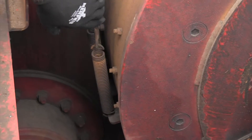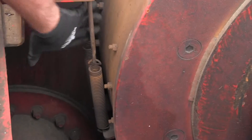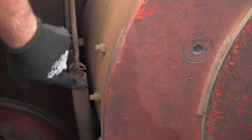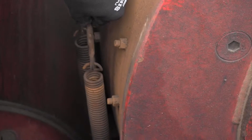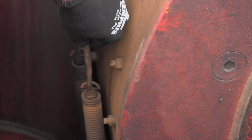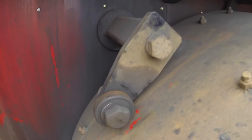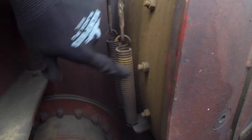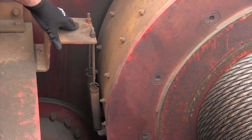In this case these springs could be a little bit tighter — it's kind of a feel test. Just a little bit of spring tension is what you want to see. This can move around a little bit more than we'd like; we'd like to see it a little bit tighter. Once you have all this set, you'll have someone at the brake handle release and raise the brakes while someone else ensures that the flange is contacting all the rollers and that the springs pull the brake band away from the brake flange.